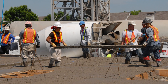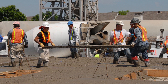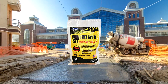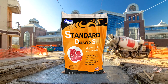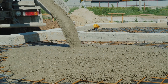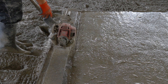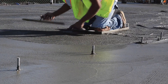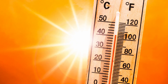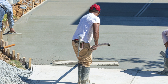It is commonly known that concrete placed in hot weather has an accelerated set time, which is why we offer set delay admixtures such as Mini Delayed Set and Standard Delayed Set. These products help slow down the hydration rate in the concrete, allowing you additional time to place, screed, and finish the concrete. But as the weather becomes hotter and drier, you might find you need some additional help with just that top surface layer.